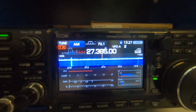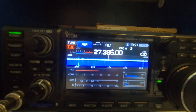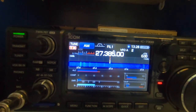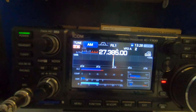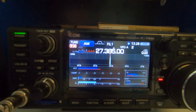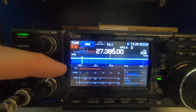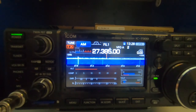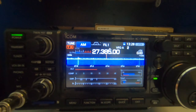We got it back inside here. Basically, I took it outside the cage — those luggage racks. I was figuring that maybe that's going to help, but look at that. All of a sudden, once we start modulating, we're getting about five bars on the SWR meter and we're almost at 1.5. That causes an issue once we get into putting higher power through that antenna. So let's go ahead and move that back and verify everything's good. I'm not doing anything except relocating the antenna — I have not changed the adjustment of the whip whatsoever.